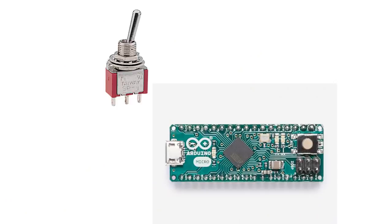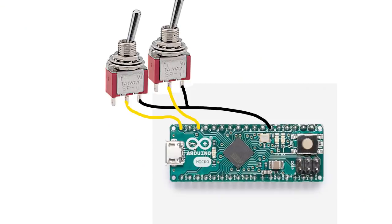All the switches are really easy to wire up because all they do is connect between an analog input pin on the Arduino and the ground. If you have lots of switches close to each other, like in the throttle case, you can simply wire one ground wire from the Arduino up to where all the switches are, link all the grounds together, and then have the other pins connected down a long wire to the Arduino. So although you still need a wire per signal pin, you can run just one ground wire for all the switches, which makes it a lot simpler.